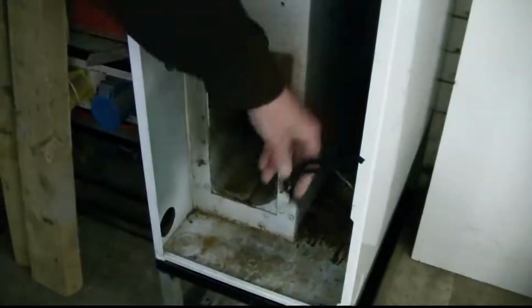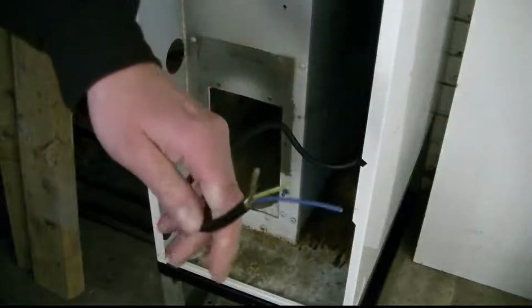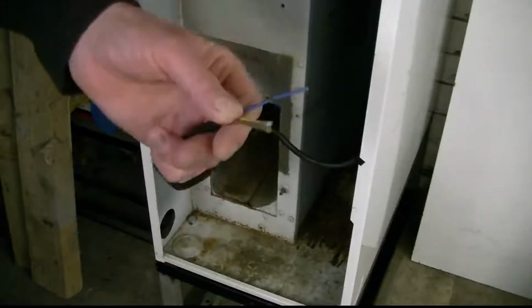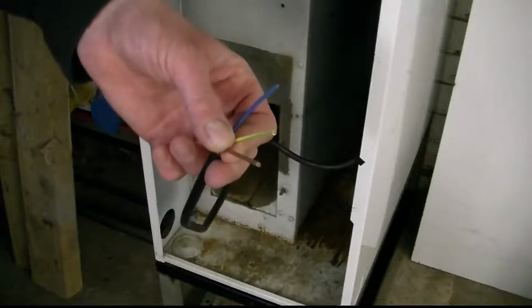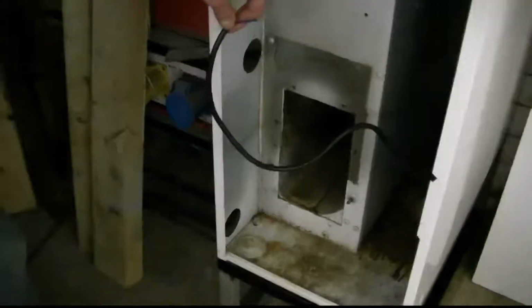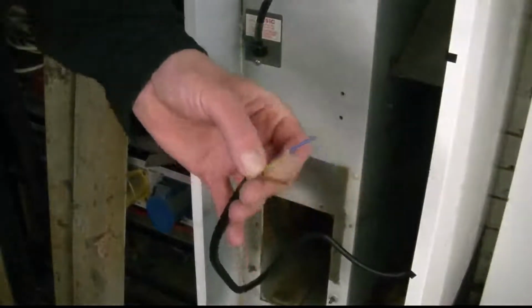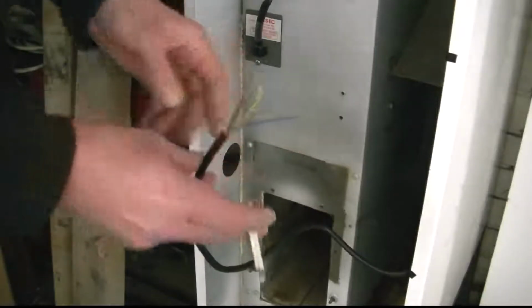this wire here. Sure it's off. This went to the gas valve, and again I said in an email, is it okay to run that burner off of this, because this cable becomes live when the thermostat calls for heat. So when it's satisfied via that there, this is dead. So that's correct, isn't it? Sorry, no, that's a load of bollocks actually.